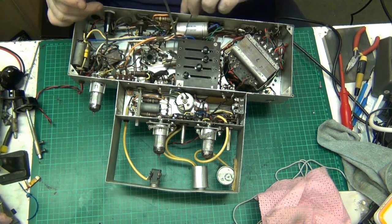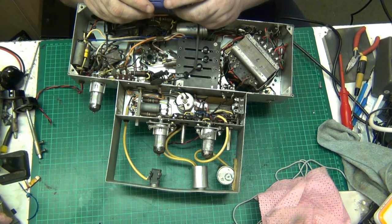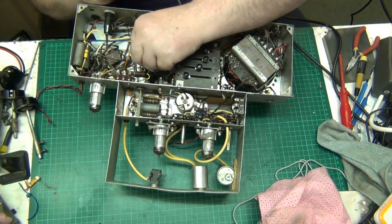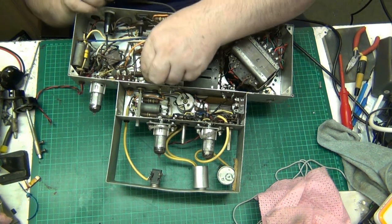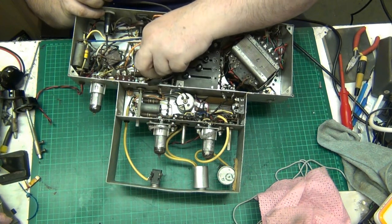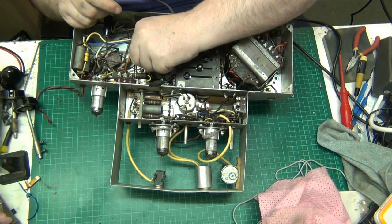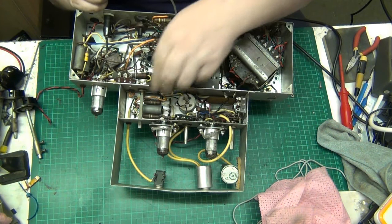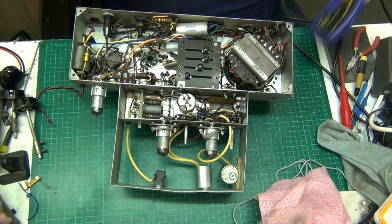So we'll connect that to there. We'll just check, make sure it's not two in one of the cans on earth. In circuit leaky. Open circuit or low capacitance. Right, so it's two capacitors and the can's acting as earth. 28.59 microfarads. Right, I think we'll put three of them on the list.